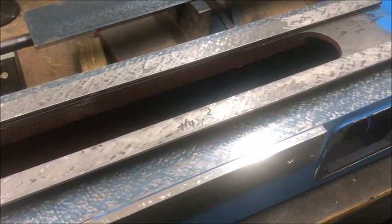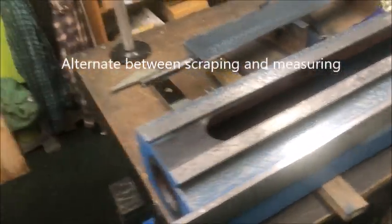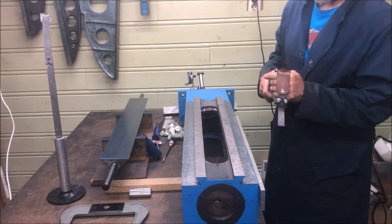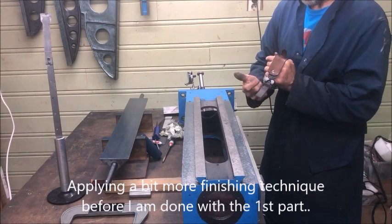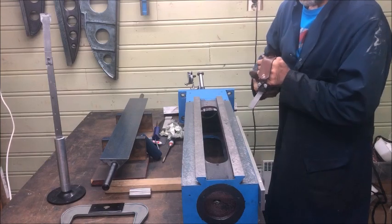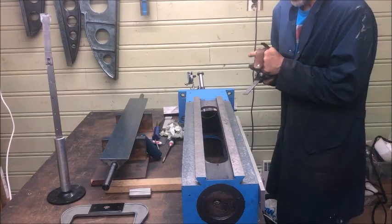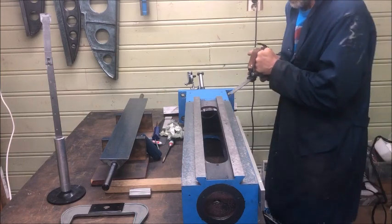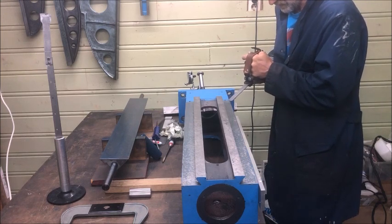So I'll measure with the pins and of course bridge across. Now I will use a slower speed and a little bit more curved blade, and also a shorter stroke to make more finish cuts — hold it, touch in, going like this and going forward like this, not touching the corner, taking that on the other side.